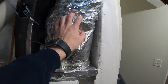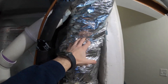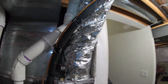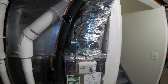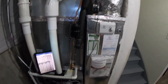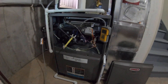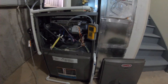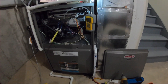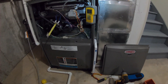This fresh air damper control — I don't even count it because it's flex and it's not always open. At most it gives you about 80 CFM or less, which is basically nothing — it's just fresh air supplying the furnace. You can see how badly designed this furnace setup was. That's why our static pressure on the return side is so high at 0.66, when it should be much lower than that.